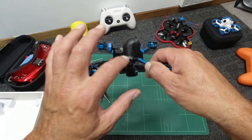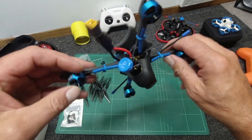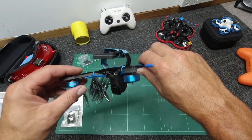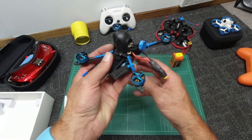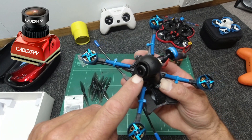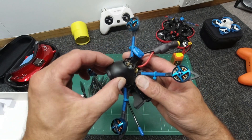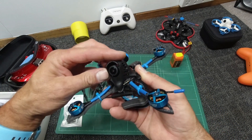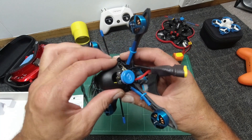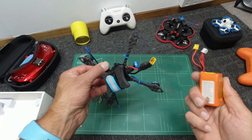All-in-one board on this, guys, which is really neat. It's a 20-amp ESC, so everything is there. Micro SD on the side, antenna nicely mounted on, cable tie on — so that's something you don't have to do. Anything from 2 to 4S will be ideal for this unit. Back to the camera — it is an absolute ripper. This is the Caddx Ratel 1200TVL FPV cam, nicely enclosed in very, very hard plastic. Should that take a knock, that's going to protect your camera and your flight controller really well, because that is as solid as solid. XT60 plug — so if your 850 runs an XT30, just get yourself an adapter and you'll be good to go.